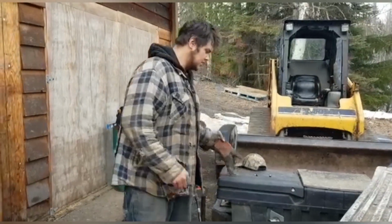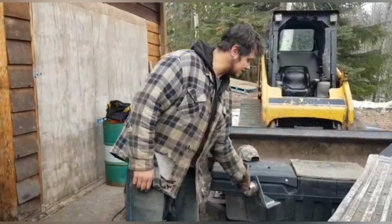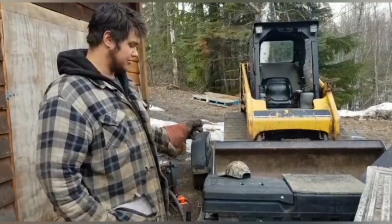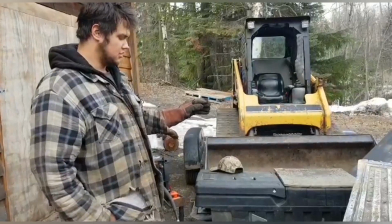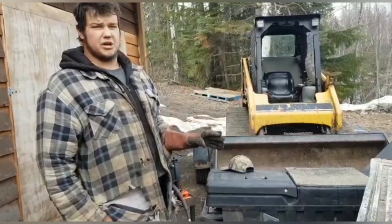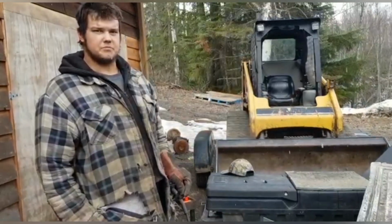So when you're welding from something that's about this 1/4 inch thick on something that's a lot thinner, which this trailer is, which is probably about 1/8 inch, I like to do something I call a dab and drag. I start on the thick metal and just touch down onto the thinner metal, so that way you can kind of maintain an equal heat between both metals and get good penetration on both of them as well without burning through on the thinner metal. Make sense?